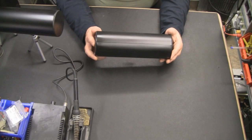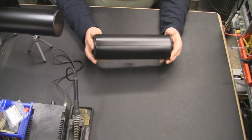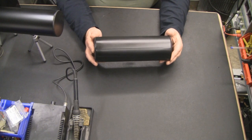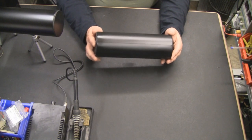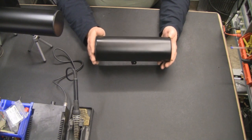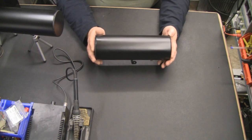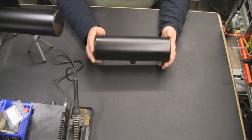In this video I want to revisit the cantenna that I did in my very first video uploaded on YouTube on this channel, because I've done quite a few different changes to that design since I first uploaded it. We're still going to use a toilet roll holder to base the antenna on.